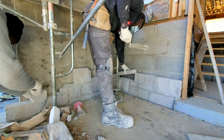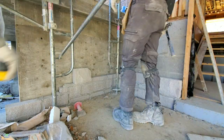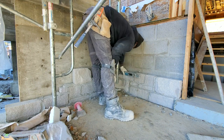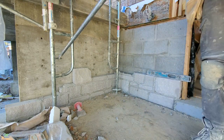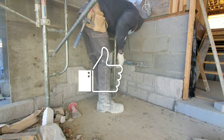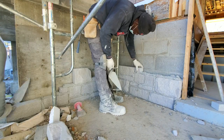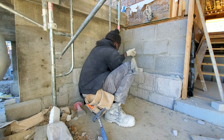Here I have Sanjay at the front laying stone. I like to give my guys the hardest part of the job to start — that's how I teach them. Once they learn past the hardest part, everything becomes easier. I have him right at the front trying to build a corner. Once he lays a few stones he's going to put a reference line there to use to build the corner up. You'll see him there figuring out how to return the corner.